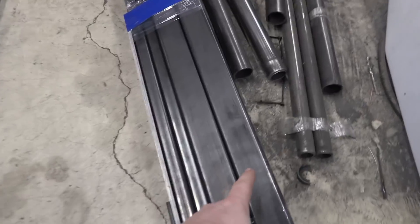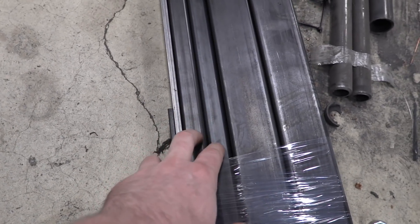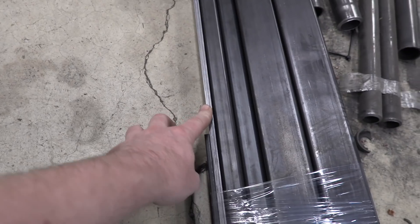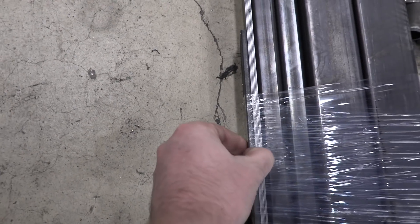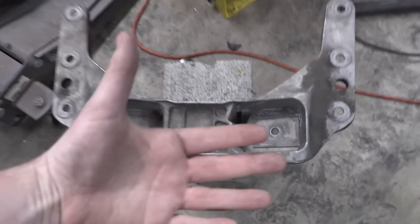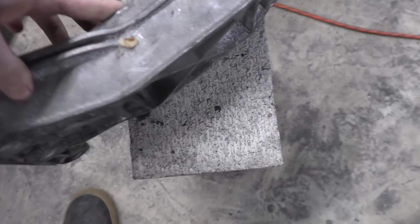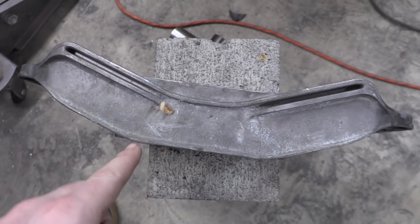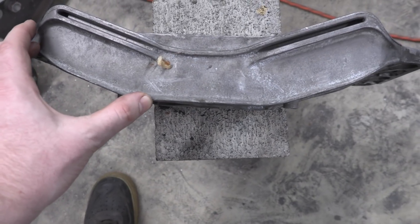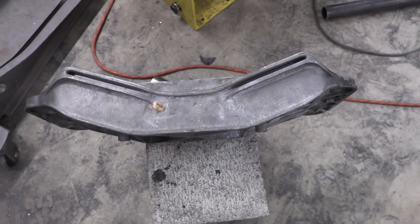Back in the shop, I've got all my steel out. This steel is for further reinforcement around the rear differential. This steel is what we're building our bracket out of, this is the gusseting sheet metal for gussets around the roll cage, and this is quarter-inch thick flat bar for building brackets. I'm going to get started on building the part that holds the bottom of the transmission. I'm emulating this piece right here — it angles down, goes flat, then angles back up. I need to match these angles exactly because that's the angle the transmission mount sits on.